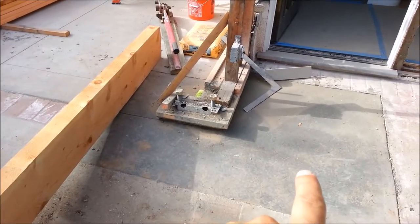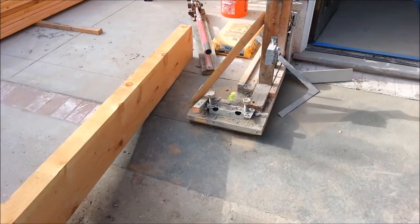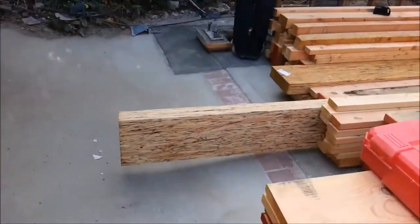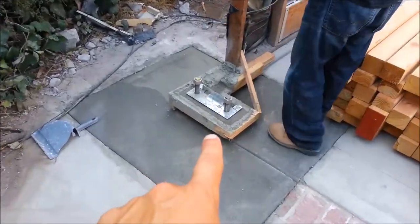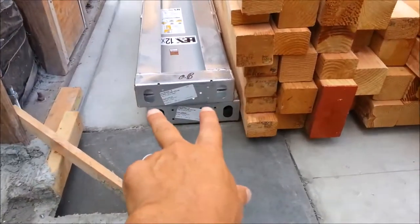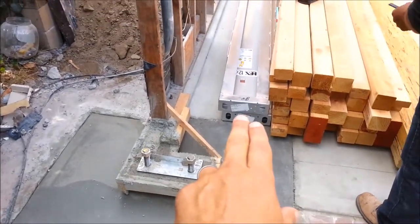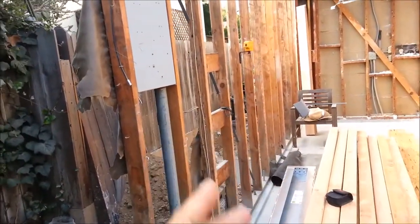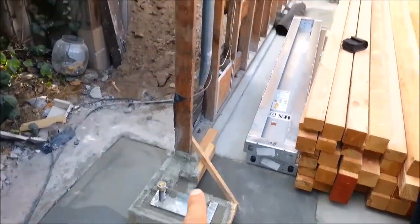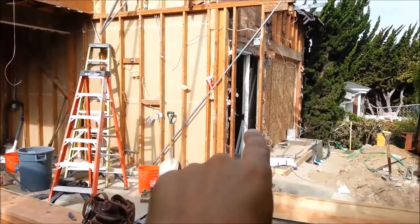When we last saw these, the foundations were empty. We filled them up with concrete and we set our bolts using templates for our hardy frames. Here's the other side of the garage door opening — that's a hardy frame right there. Those bolt holes sit right down there. That steel wall acts in place of about six or eight feet of shear wall plywood. You bolt down here, bring it up, and bolt to a header all the way across to that hardy frame right there.